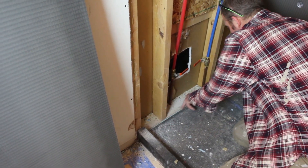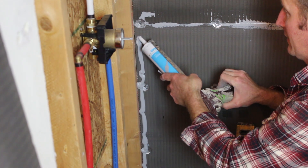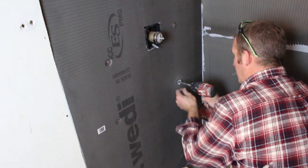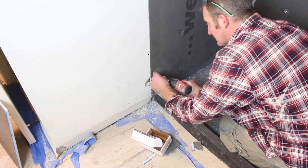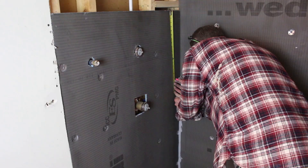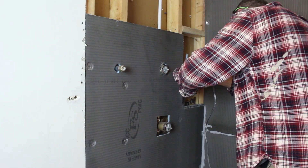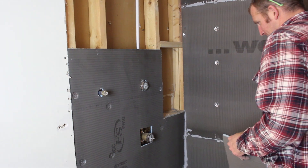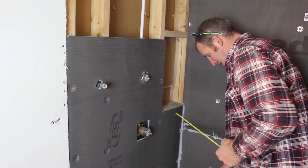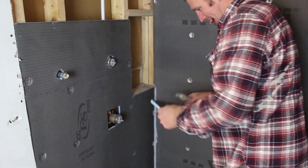Let's clean out that dado joint. We'll measure down to the bottom of our niche and cut this out at about 17½ inches. I would recommend if you're custom-making a niche to put the bottom sill plate down first, then finish the side. We've got basically 10 inches, so we'll cut a square piece at 10 inches.